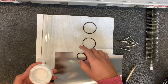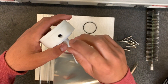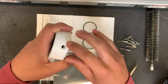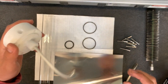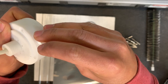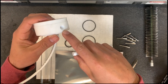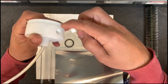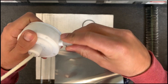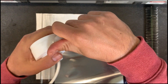It takes two of the bigger o-rings for the outer. When rebuilding a pressure unit, we have sealing washers — a stainless steel one and then a rubber one — to seal it because it gets pressurized. This vacuum unit does not require those. You just get your counter fitting, give it a little back turn to make sure it's set. It does not take the stainless steel or rubber sealing washers. Same as shown in the pressure cell rebuild video — start off slow and don't cross-thread or crank them down too much.